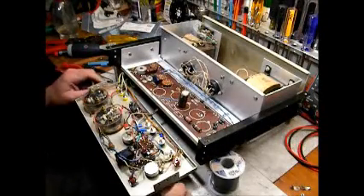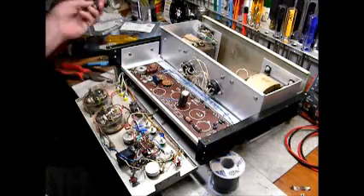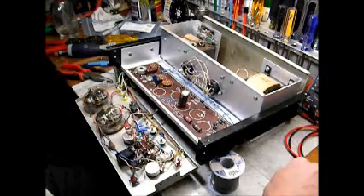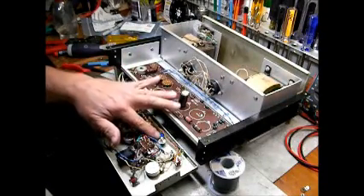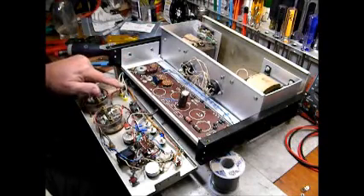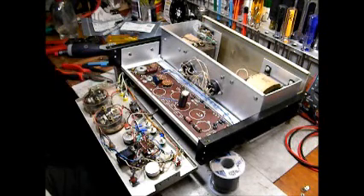We've got the front panel disconnected here and laid down. I've pulled all the old rotten, tired, sad binding posts and put all the new binding posts in the little metal brackets they originally came with. These clips don't fit over the binding post ends I got, so I soldered new round end connectors on. For the voltage taps — 12.6 and 6.3 — these were soldered originally, so I just re-soldered them to the back there.